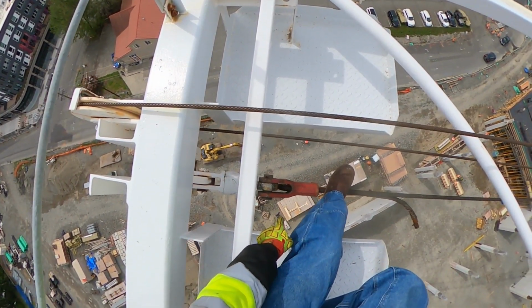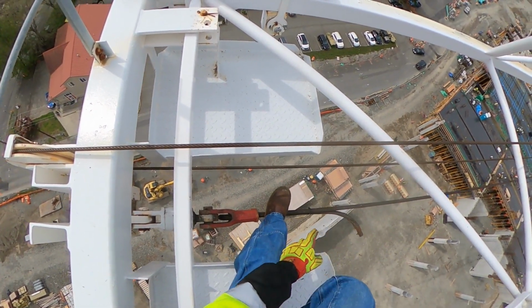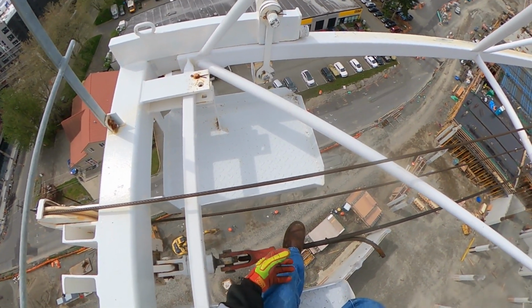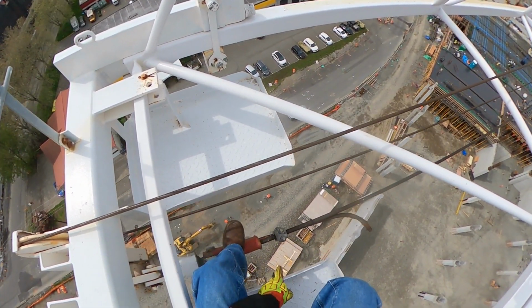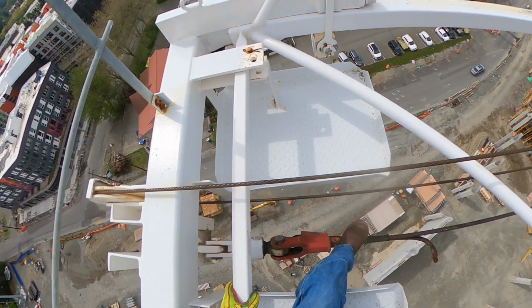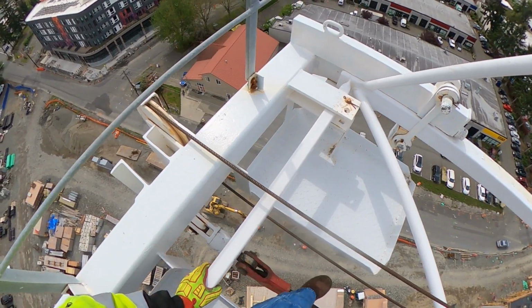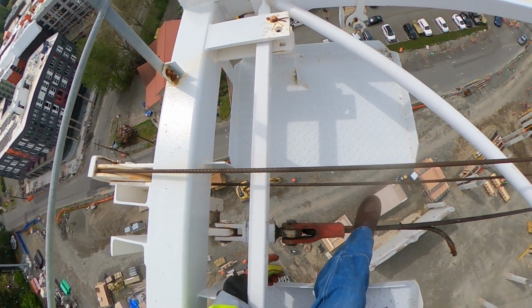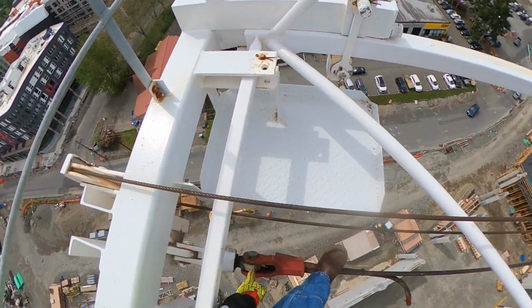This is called a becket. This is where the hoist line, this is your hoist line. The hoist line comes through, runs through the becket and gets locked off right here. You want to come out and make sure that the becket is still moving around, still secure. There's keepers in there, the pins are in there. The pin in here, there's a keeper on that side.